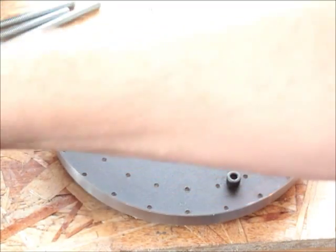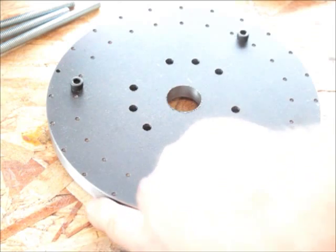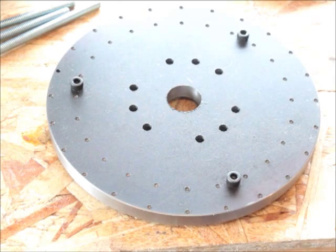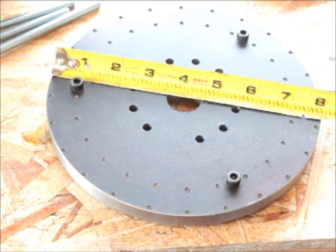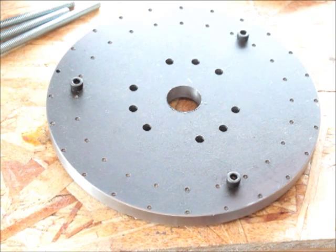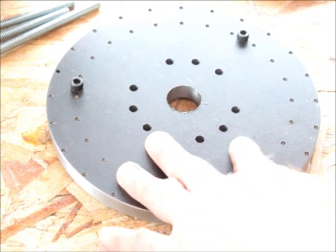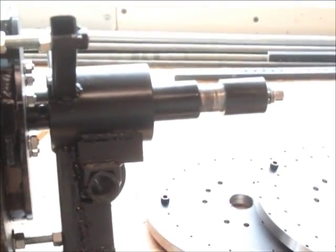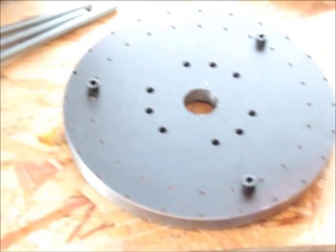When it's in the raw form I'm able to hold the center — there's a quarter inch center hole on the other side — so I can machine this very accurately as far as cleaning up the outside and boring that center hole. The outside diameter is seven and seven eighths across the diameter, almost a perfect seven and seven eighths. And then the center hole is one inch to fit the back of the axial flux alternator, where the blade goes.